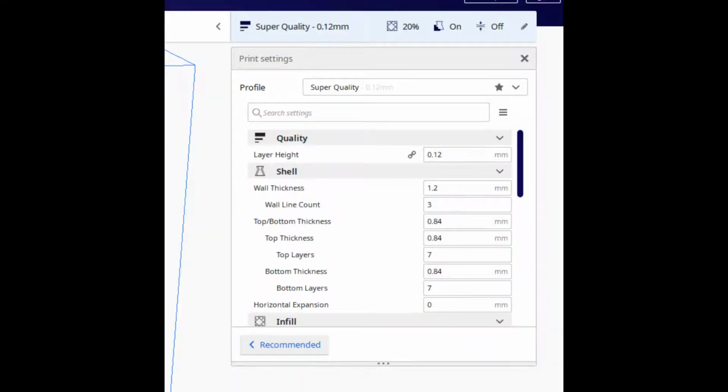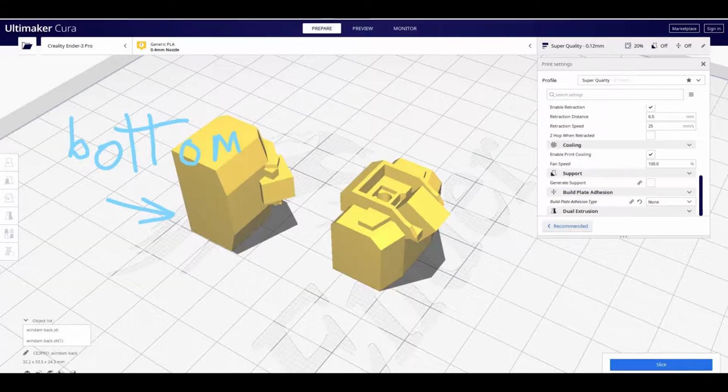The 0.12mm in the Z axis does vary with slicer settings. My slicer is set to 0.12 layer heights, as this is the minimum the stepper motors in my Ender 3 will move up.